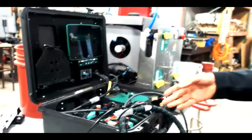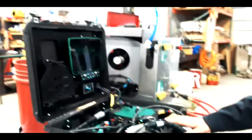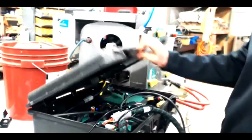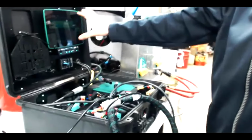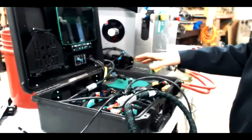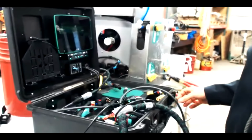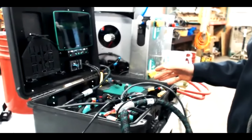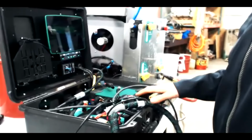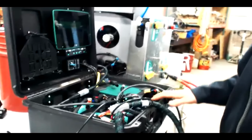One last thing I want to show, just so you're aware, is a new tool that I have as a dealer called Mobile Max. It's a 2-row planter in a box. This is a case that I can bring out to the field with a Gen 3 and a known good system. I can take full control of any row on your planter. We can swap harnesses out, PDM, or SRM, to try to isolate a known good system to what might be wrong on your planter.